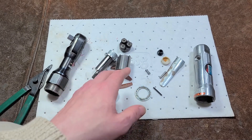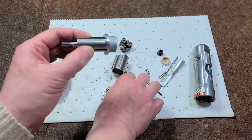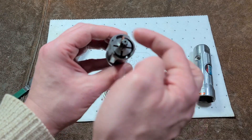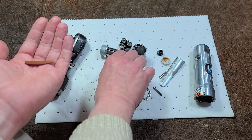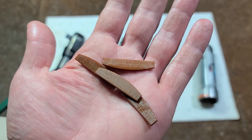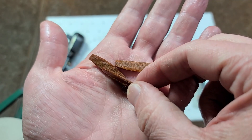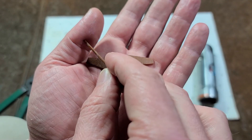Sorry about the focus issues. It's nice to be able to conceptualize how the vane works — the rotor is offset so that air pressure, as it expands, pushes against the side of the vane. The vane is what takes the most wear. These vanes are actually not made out of any form of metal — they are a fiber composite material, which provides both rigidity as well as being lightweight and kind of self-lubricating, giving a surprising lifetime for something that is constantly rubbing.